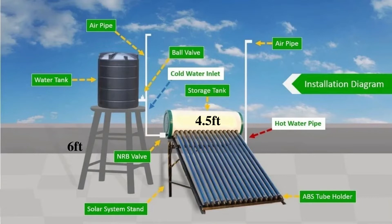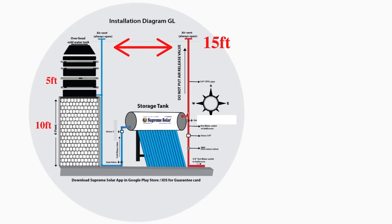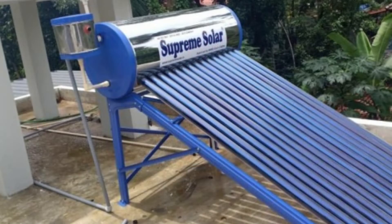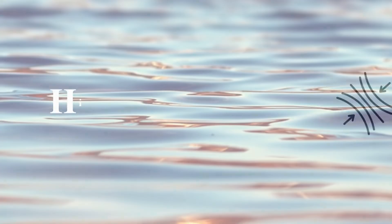Sometimes people build a room on the terrace and place the overhead tanks on it, which can be 10 feet and above. The length of the air vent pipe should be equal to the height of the overhead tank, and when this happens, the air vent pipe will bend if it's too long. That's when the AUX model should be used. In the AUX model, the solar water heater considers the small auxiliary tank as the overhead tank, so the height of the air vent pipe reduces and it won't have bending issues. You should buy the AUX model if the overhead tank on your terrace is too high, such as 10 feet and above. Bending of the air vent is an issue because if that happens, pressure won't be able to release from the solar water heater tank and the tank will be damaged.